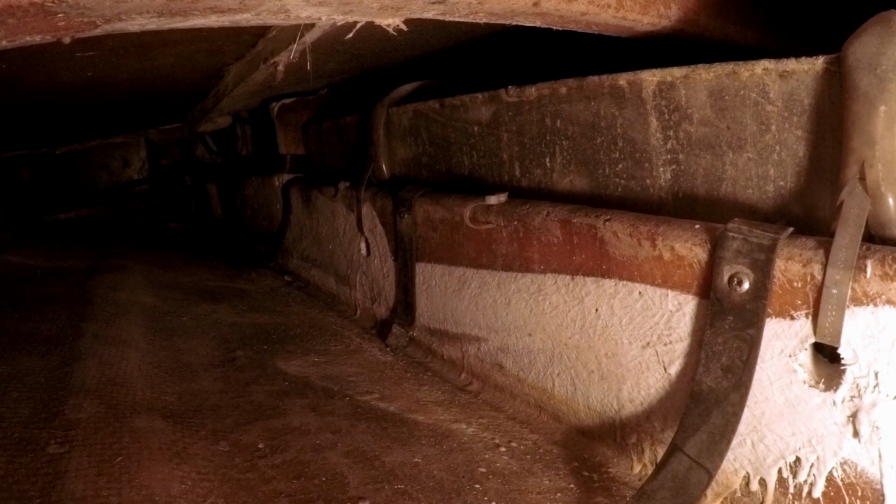The black foam above the tank is a liner between the upper and lower sections of the boat. One of my immediate concerns is the condition of the stringers, but they look solid. The junction between the stringer and the bulkhead looks clean and intact. For now, I'm optimistic. At least the holes through the stringer for the support straps were protected with gel coat. I'm sure that there's a better way to install the new tank than this.